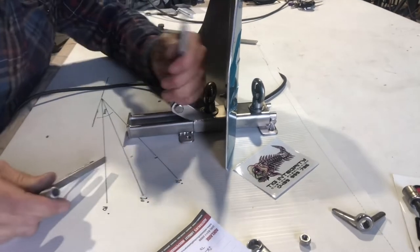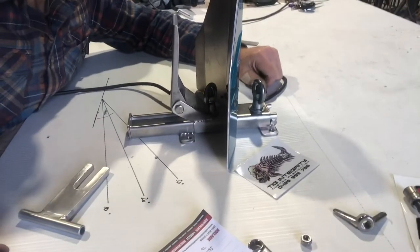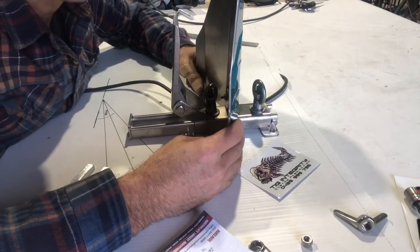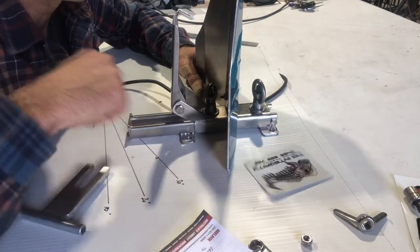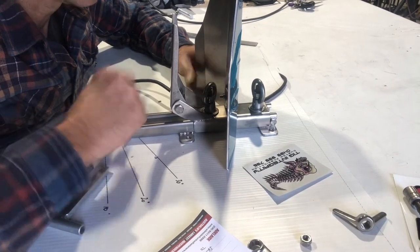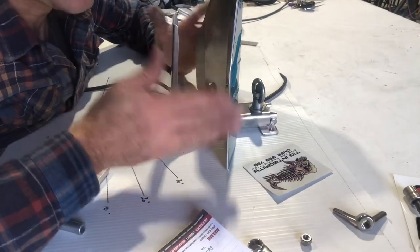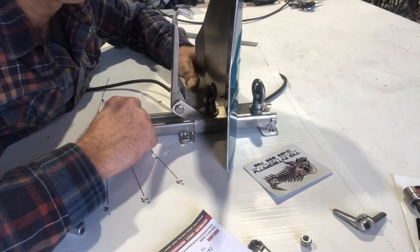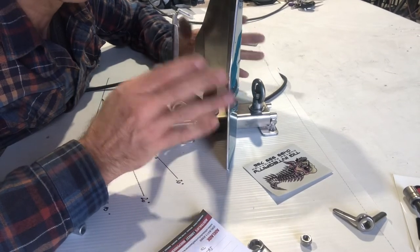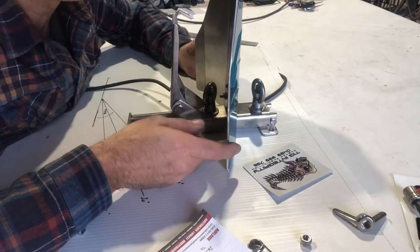Everything's locked up safe and secure for your trip home. I'm doing these in aluminium cover plates because most of the boats buying these sliders are plate aluminium boats, so aluminium is a lot easier to work with than stainless. With stainless I've got to polish it all up and if you want to make changes it's so much harder — you've got to polish the join. With aluminium, if you want to make any changes it's much easier, so it just makes it better for everybody.